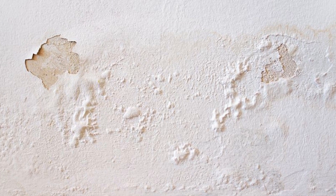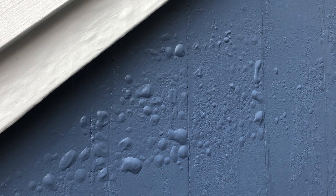The second step is analyzing the surface. By analyzing the surface of the thermoplastic substrate and the type of film used for the graphics, it will help prevent outgassing or even reduce it. If the surface is old, there is a fair chance that any outgassing has already finished. Even painted surfaces may cause issues, particularly walls painted with water-based paints. By doing so, you can avoid the bubbling problems, ensuring the sign is visually appealing, long-lasting, and passes on the intended message.